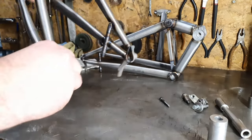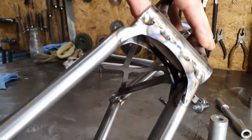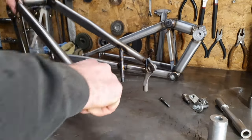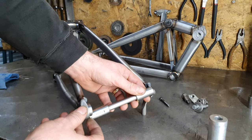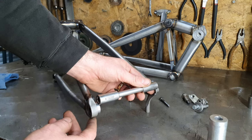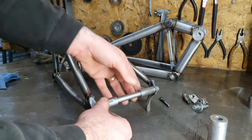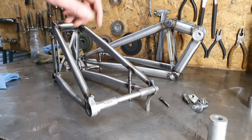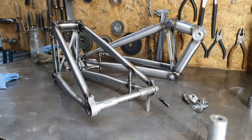And then rear axle will have closed up because of the welds that we do on here and here. It causes the back end to squeeze in. So that is not going to fit in. But we squeeze it in and then check the alignment. And then based on what it tells us, which one of these we need to pull out. So I'll just bolt all this up and then go over to the surface plate.